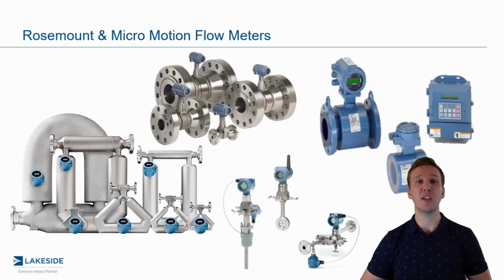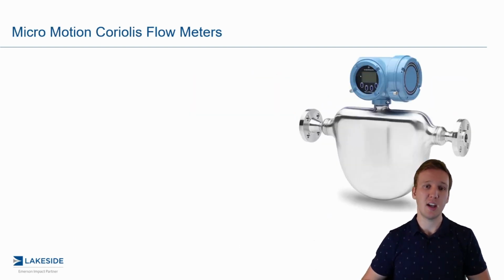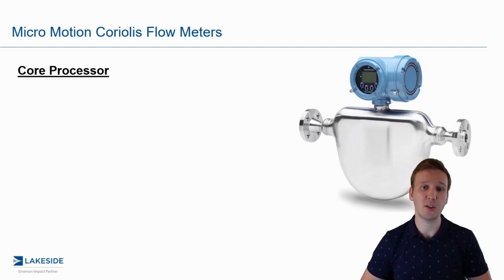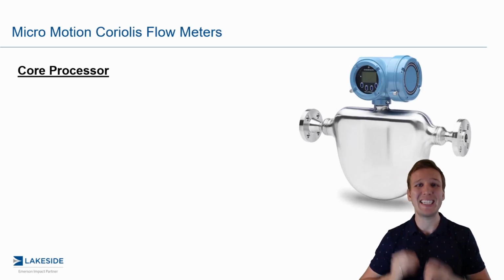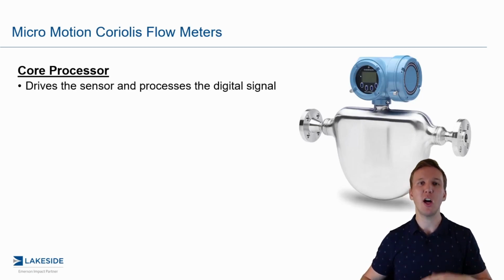Today's video, we're continuing our discussion around Rosemount Micro Motion flow meters. More specifically, we're talking through Micro Motion's Coriolis flow meters through something called core processors. Now, if you've ever worked with our Coriolis flow meters before, you'll often hear that term core processor and think of it very similar to a CPU in your PC, except instead of driving your computer, we're driving our Coriolis sensor as well as processing the digital signal.